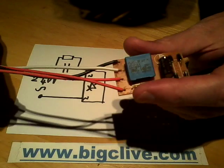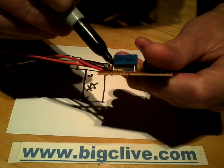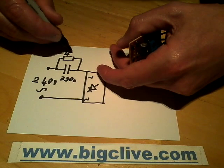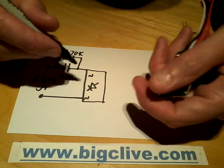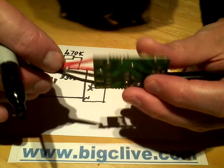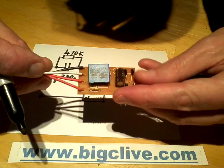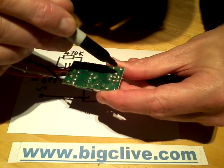And the resistor across it is yellow, violet, yellow, 470K. So that's going into the bridge rectifier. That seems to be all the circuitry on the input. It's really very simple. It's a very typical capacitive dropper. The output of the bridge rectifier is these two outer connections here,